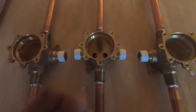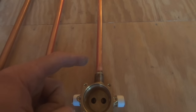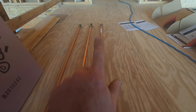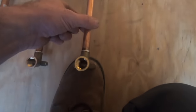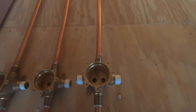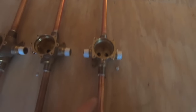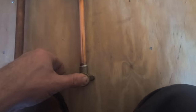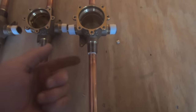I find that if I do the long part first, I make sure this is sitting flat on the floor and the drop ear is sitting flat on the floor. Then I literally just take this and set it on the edge of my toe, and that gives me enough height that I don't catch the floor on fire. Once I get it soldered, I drop it down, make sure it's square, make sure this piece is pushed in, and then push it down. Then raise it back up on my foot again so I have the clearance to solder that.